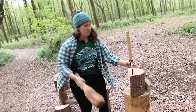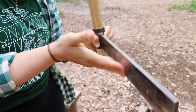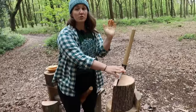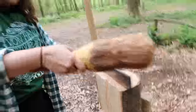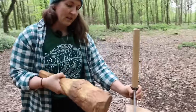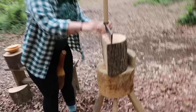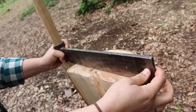It's a little thing I definitely teach to anybody that feels like they don't have the strength to do this. And I want to hold the fro down low and close to the blade. This isn't typically sharp, but you're wanting to keep it down there, because if I hold my hand up here and hit this, there's a vibration that goes through the handle, and I've actually bruised my palm before if the wood is particularly hard. So you want to hold your hand down here. I'm going to tap slightly to get it to bite a little bit. And then I'll do my, might have to readjust. I want to make sure that I'm going in the same space. If the fro moves, every time I hit, I'm sending in little cracks, and I really want to avoid doing that.